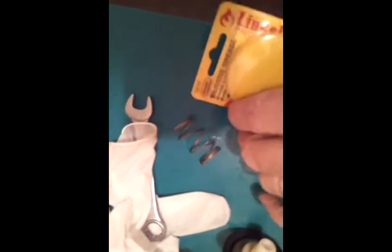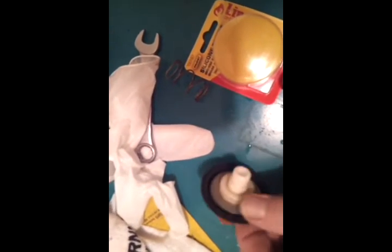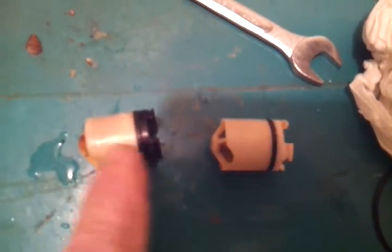Get yourself some non-toxic grease for faucets or what have you, and lube up all your O-rings and your shafts that slide in O-rings, and the O-ring on the outside of the checks. Get those just lightly lubed up so that everything slides in and out — if you ever have to pull it out again, you're going to be happy that you have a little bit of silicone grease or food grade grease on there. When you put them back in, make sure you've got them in the right direction — this is the number one, that's the number two — and all you'll see is the tip of each one hanging out of the inside of the backflow preventer.